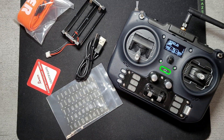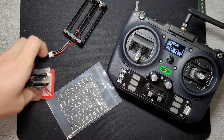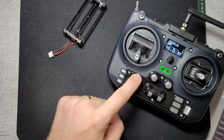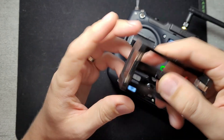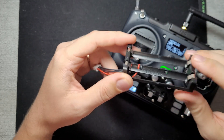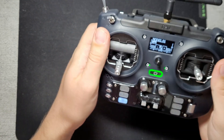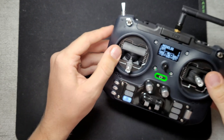In the box it comes with an ELRS manual, neck strap, USB-C charging cable, a set of stickers which you stick on the six illuminated programmable switches, and a battery holder that doesn't hold the usual 18650s — it holds the bigger 21700 cells. You can put two cells up to 2S 5000mAh capacity, which will give this smaller form factor radio quite a long on-time, even with a big LRS module on it.